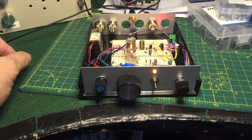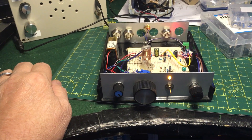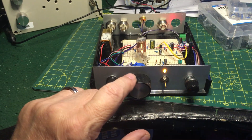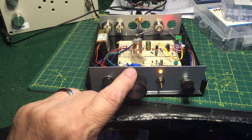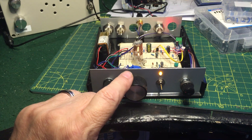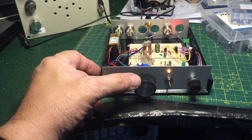It's got nice fine tuning on it. It uses varicap tuning, so it's got a 10-turn potentiometer which tunes the 40-meter band. So you've got 10 turns covering the 40-meter band, which is quite good.